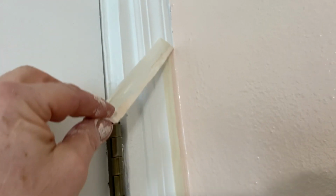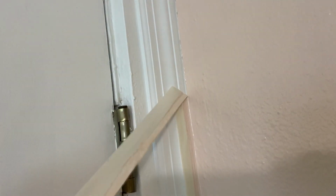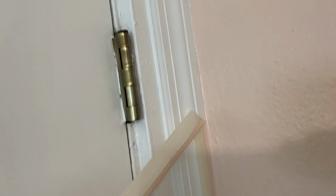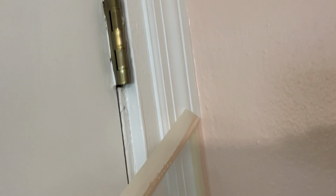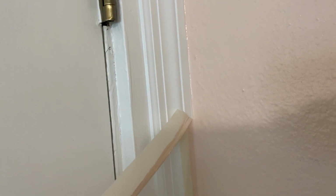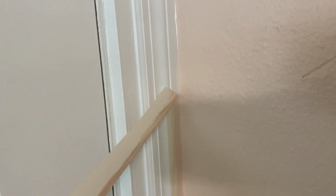Look at how nicely the caulking system works. Just anticipating a question from viewers on this method right now. They'll usually say, how long before I pull the tape? As soon as possible. Don't let it set up. Pull the tape off while the paint is wet, yes. I know you're going to do 2 coats. You want to pull this paint off ASAP. Otherwise, you'll have what's called bridging.